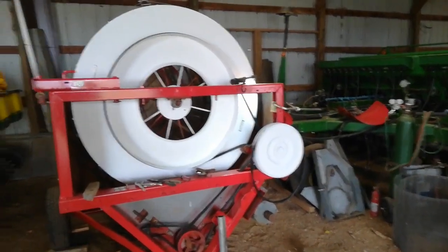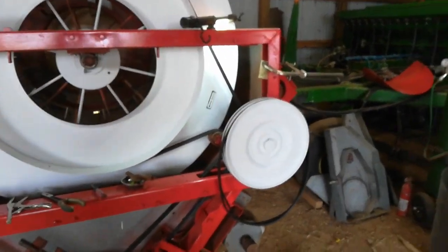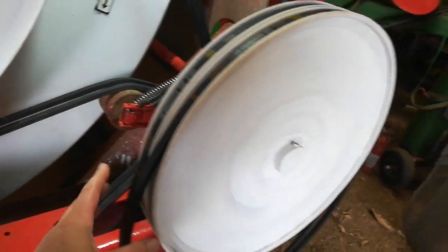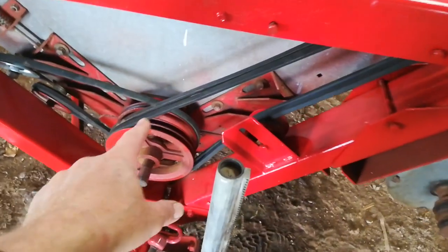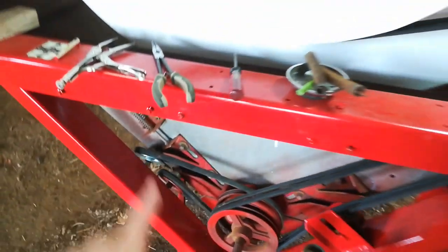Back out here at the rotary grain cleaner, it's the DMC 54. All new belts — 10 belts. We're going to attach this one to the drive motor, these two down here, that one over there. New idler pulley.